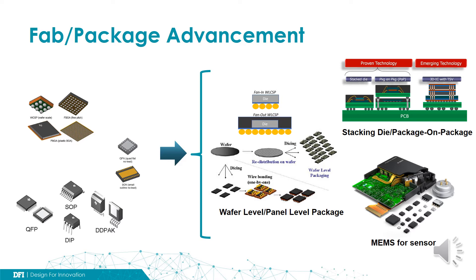In recent years, the wafer-level chip-scale package is one breakthrough to reduce the IC footprint. This technology allows the IC final package to be very close to its die size. It accounts for roughly 20% reduction in footprint — a very good advancement from the legacy design. The other technology breakthrough is 3D packaging. We can now reduce the footprint by stacking multiple die or stacking multiple packages into one, which will greatly reduce the board space required to pack more function in a small footprint.